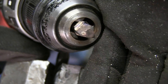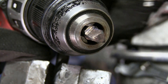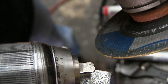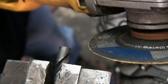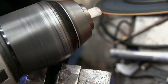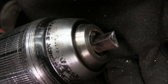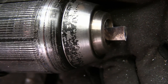If you have a look at the tip of that, she's pretty gnarly yet. We want that to have a nice little dish so it makes a good press tool. The way we do that is we run it here, and the concavity - well, you'll see. Okay, now the press tool has a perfect concavity, but still got a bit of a rolled-over edge. Nothing we can't touch up with the stone.